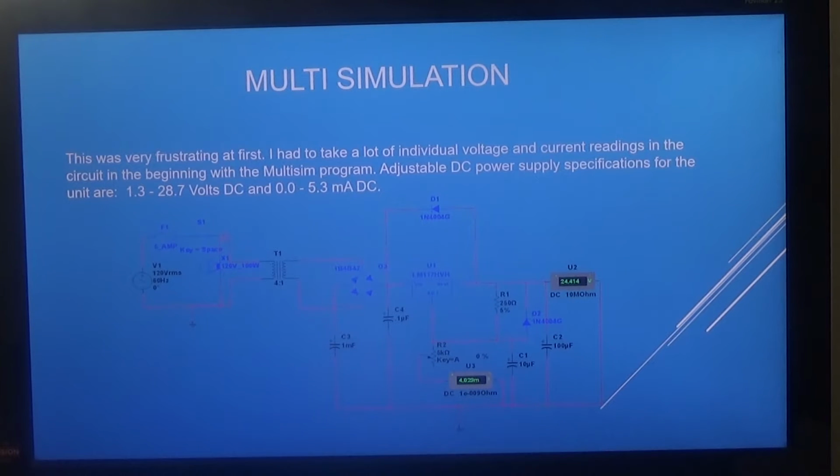Also with that, I still have control of the voltage, monitoring the voltage across my output and increasing and lowering the voltages with that potentiometer, but at the same time still monitoring a steady current level of the current that we're seeing inside the circuit.